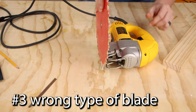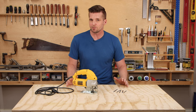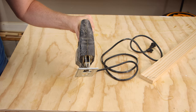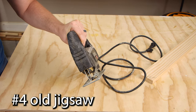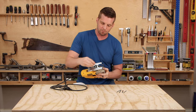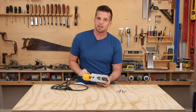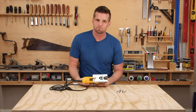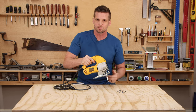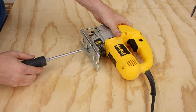To summarize: you can't just slap any blade in the saw and expect great results even if it's brand new — make sure you choose the right blade for the job. I'm hesitant to blame tools, because with enough skill you can make even a mediocre tool work. But the jigsaw seems unique in that a cheap or old jigsaw that vibrates and chatters a lot can be a nightmare. It's top-heavy with a small base, the blade isn't supported at the bottom, and it cuts by moving up and down really fast — none of that lends itself to stability.